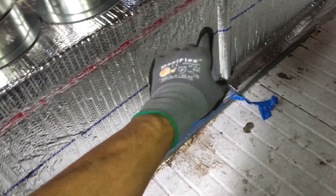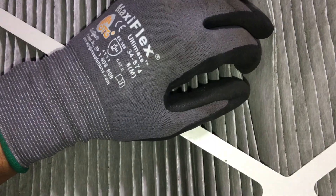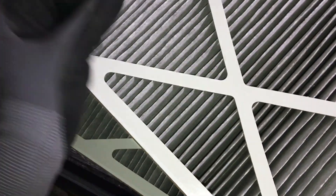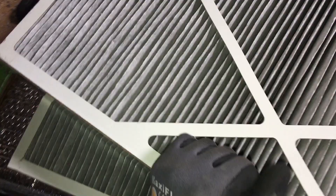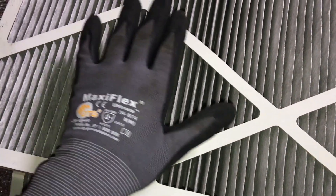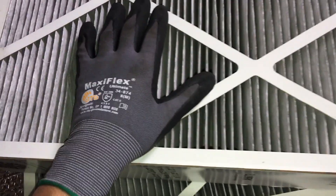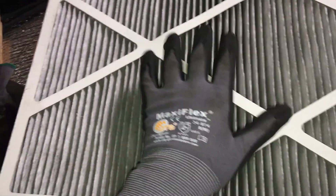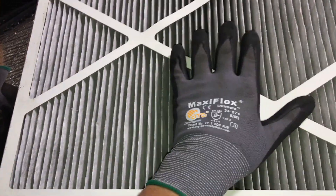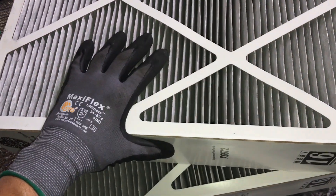That's something I still have to do — put a manometer on there. But we put the unit back up and running right now. I disconnected the condensate pump and we're going to allow the water to do its thing and look for the problem or see if it's solved. We're still trying to determine what caused the secondary condensate pump to kick on in the first place. Don't just look for the result — find the cause that caused the result. Don't just cure it and walk away.